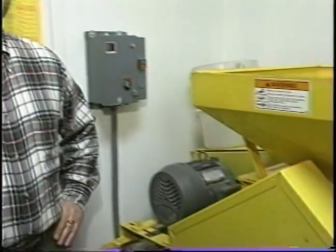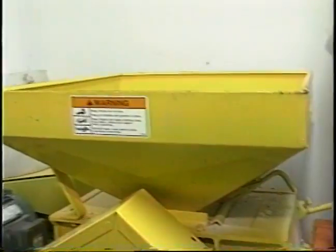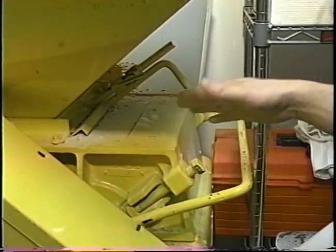And approximately how long does it take to crush, for instance, 100 pounds of grain? For a full-size brew for us, which is about 600 pounds, takes about a half an hour. High-capacity mill. Yeah, absolutely. Very efficient. And is the crush adjustable? Yeah, you can adjust both the consistency of the grind and how fast you want the grain to go through the mill. Basically, the log jam would be the auger. You can mill it faster than you can convey it. So there's a little chute over here on the side, and that's how you control the speed of the grain, how fast it enters the mill.